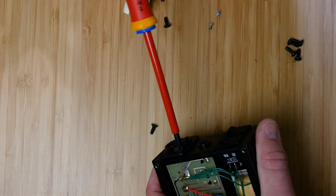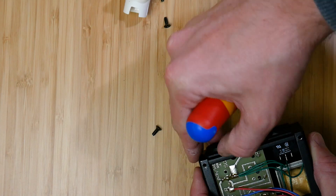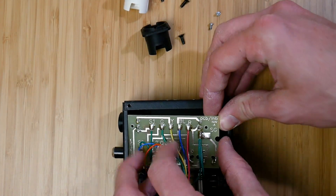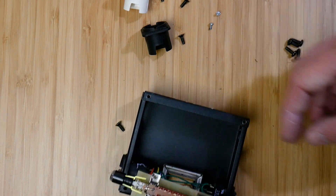Additionally it's very handy when you need to either balance and/or isolate an otherwise unbalanced signal operating at line level that needs to connect to other gear, or even just to use this box as a ground lift switch using the direct out for eliminating grounding issues when those pop up.